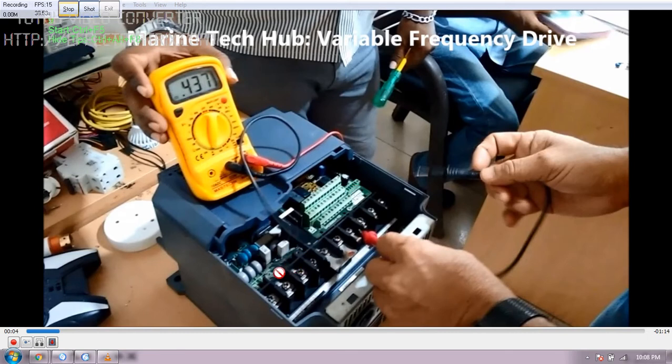What can go wrong: the IGBT can fail — that is one part. The power cord can go wrong, the controller can go wrong, or the encoder can go wrong. I will be explaining how to find one of the faults — specifically, if the IGBT is gone, how you are going to check that.